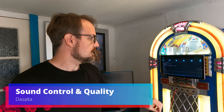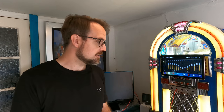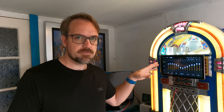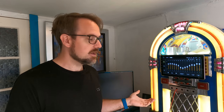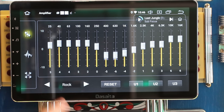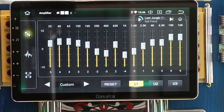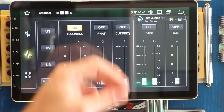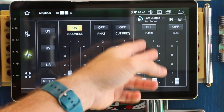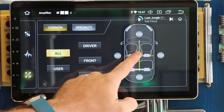So let's have a look at the audio functionality. Crucially, the DeSata has DSP — digital signal processing — which means you have more control over the audio and how it sounds. They haven't stepped away from the generic DSP settings: you get a 15-band graphical equalizer with different presets available, you can adjust any of these bars and save on three saveable memory points, and you can control loudness, cutoff frequencies, bass frequencies, and then a separate control for the subwoofer.